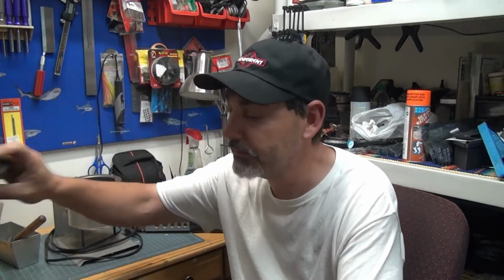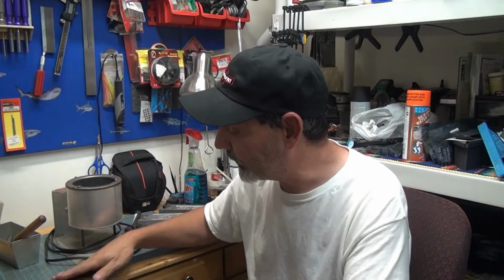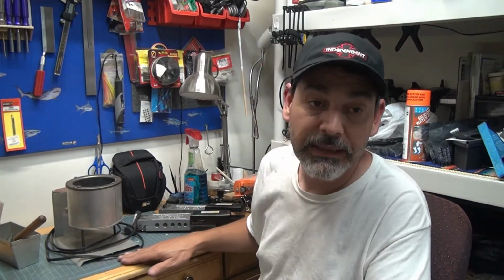Make sure you wear safety glasses, safety gear, protective gloves. When you fire this thing up, do not do this in front of kids or around kids. You don't want them accidentally putting their hands on or in or around this anywhere. And make sure you put this on a surface that won't melt, because it will get hot. I usually use a 3/4 inch piece of plywood on the bottom in case it splashes on the wood, so you don't burn yourself, but you will get splashed. It's gonna burn. So be very careful if you take on this project.